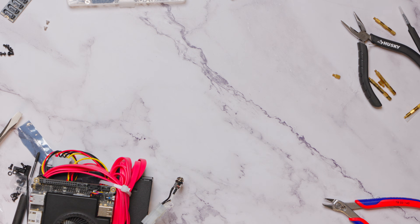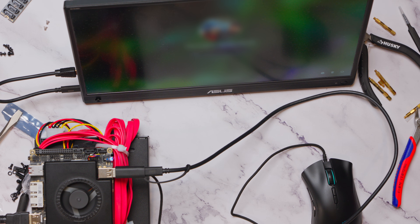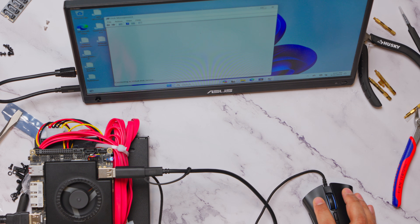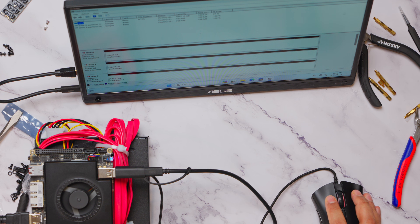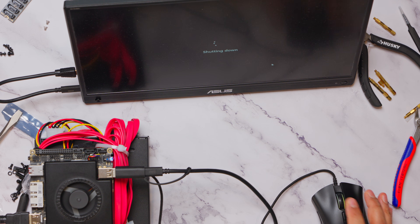At this point, it felt like a good idea to test if the drives were showing up before moving further. My SBC had Windows already installed, and after connecting the whole rig, all six drives showed up in the Windows drive manager, which was a great sign. I used an external 12-volt power adapter for the Pico PSU for this quick test, and we will show an interesting solution to that in the next phase.